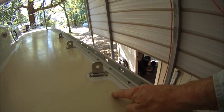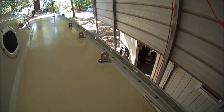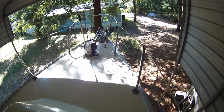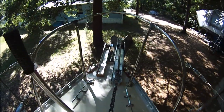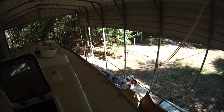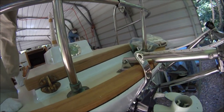Right here is where the pad eye could go for intermediate aft lowers to support an interstay, but the owner has decided initially to set up a solent stay instead. We'll either attach it here or put a pad eye back here, then store it aft attached to a shroud to keep it out of the way when not in use. And here's the external backstay chain plate.